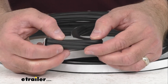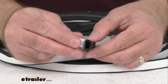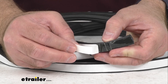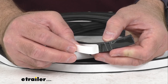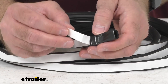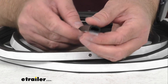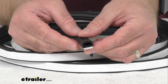and debris away to help keep your seal lasting longer. This is a peel-and-stick installation with pre-applied acrylic adhesive backing. Surface preparation is recommended to remove any old adhesive, and then you're just going to simply remove the backing, as I'm doing here, and apply the seal to your frame. You just need to use something like a pair of scissors to trim off any extra seal that you don't need, and the adhesive will set in about 48 hours.